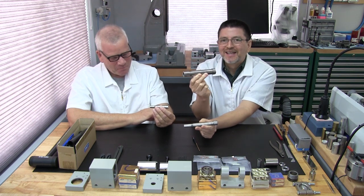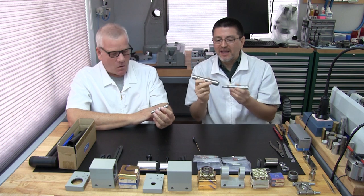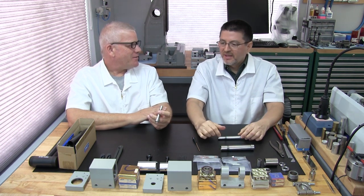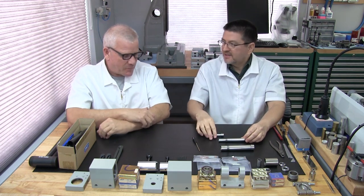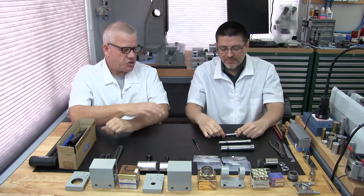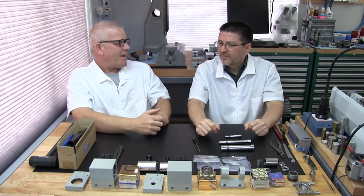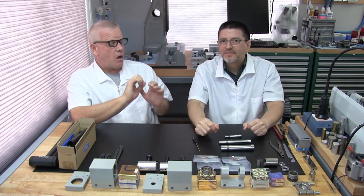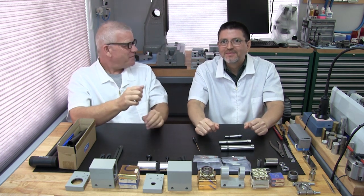Yeah. So you aren't going to see much damage with the Levin machines. No, you don't have the horsepower behind it. That's right. Even the horsepower, it's only fractional horsepower you're driving these. We just thought it was a good experience to share, because this is just general spindle rebuilding. It applies to all spindles, but there is that one area where this does not apply. Right. So you're lucky if you have one of these, but as far as tolerances go, these are far more high tolerance. Sure. So you've got a little trade-off.